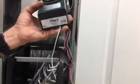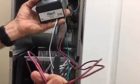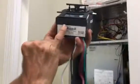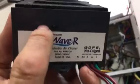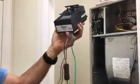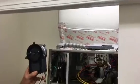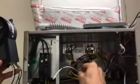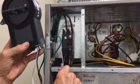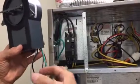There's also a connection for a 24-volt alarm light that you can buy from your local supply house. If you had to mount the unit out of sight where the homeowner can't see the indicator lights, you can set a remote alarm. There's a power button and a light button. This other terminal is just the ground. To wire it, bring your wires and hook them up at the bottom, and the ground goes to the ground lug of the system.